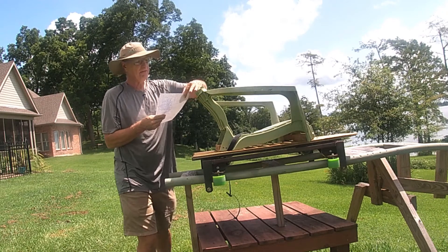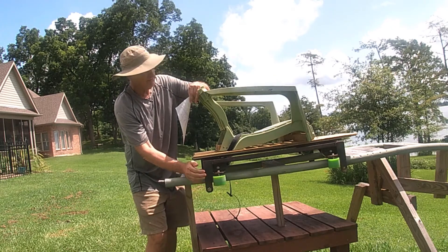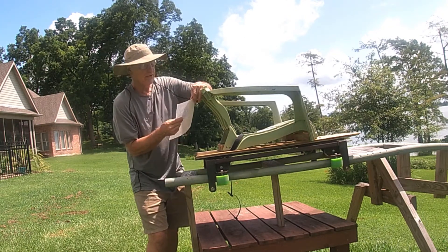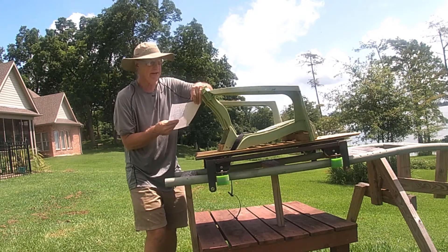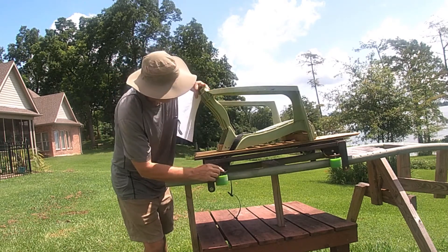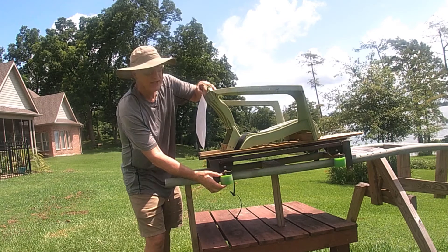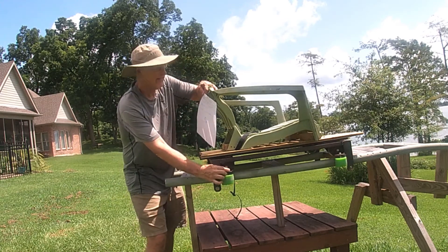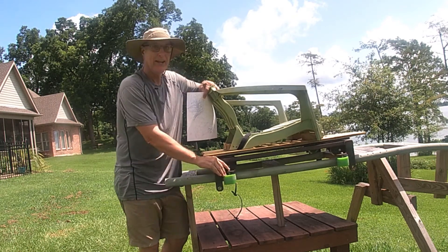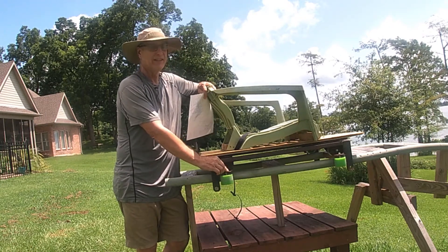The main wheels have a diameter of 70 millimeters. They're skateboard wheels — you can order them online. The width is 40 to 51 millimeters, and they have 8 millimeter ball bearings in them. The bolts that go through these wheels are 5/16 inch diameter. Get grade 8 bolts with lock nuts — you can find grade 8 bolts in special drawers at hardware stores. They're about four times stronger than a regular bolt.